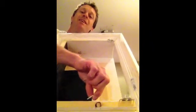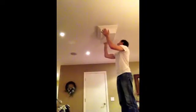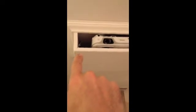The projector up there is a bit of an eyesore from the rest of the house, and it's rated at 37 decibels — so when you're sitting on the couch, you can hear it humming, which is a little annoying. So here's the box I made: a couple pieces of pine, some trim, and some hardware from door cabinets. It has little tabs that pop into a metal clamp installed on the ceiling, and a safety latch with a hook in the ceiling just in case it falls. It's got a little soundproofing inside, with room on this side for the air intake and hot air shoots out the other side. It works out pretty well, and it looks much better than a bare projector.